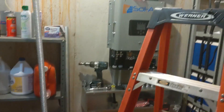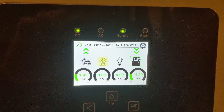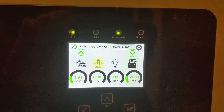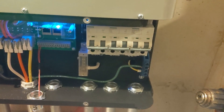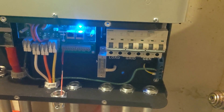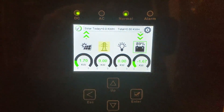That's our first DC circuit turned on. We're about ready to land some solar in the Solark. We're turning on the Solark and we are charging the battery — it's a little cloudy day so only 2kW is going into the battery. We do not have the AC side of things done; we're waiting on an electrician for this job, so we're not dealing with generator inputs yet, but we have the battery charging, and that was our goal today — to land the solar — and it's landed.